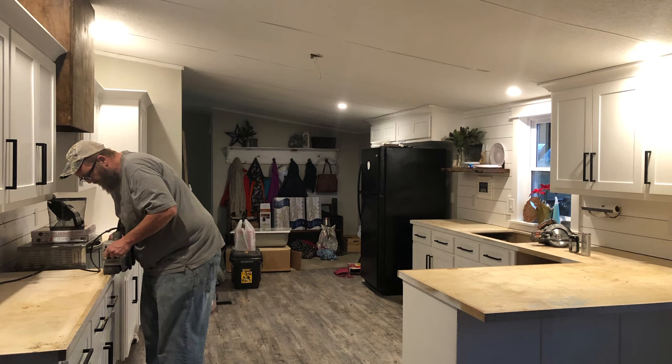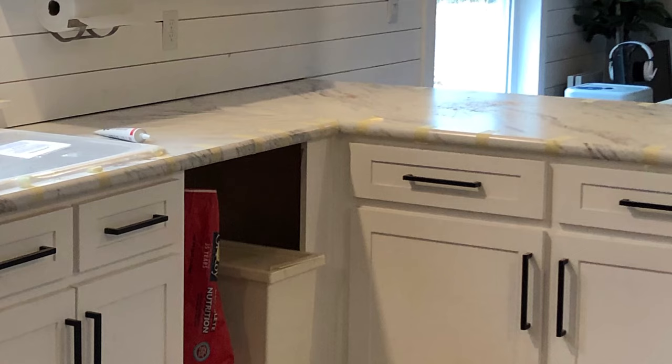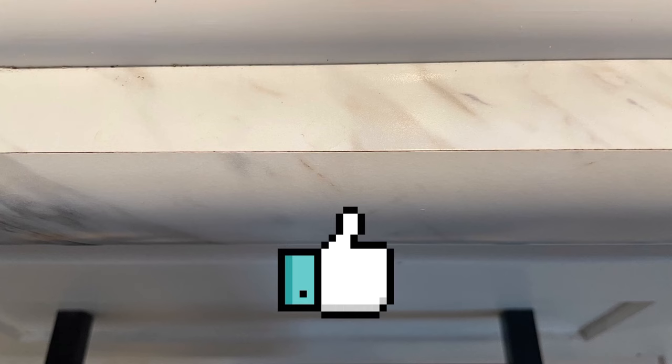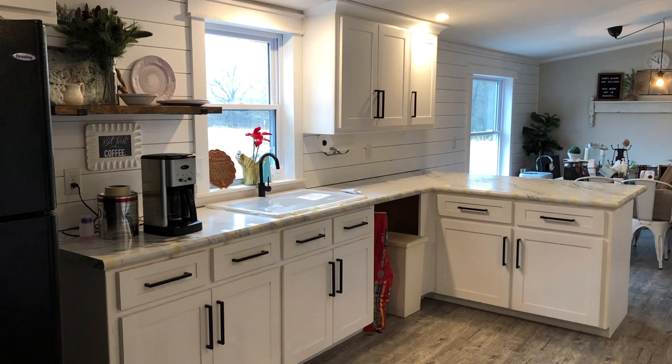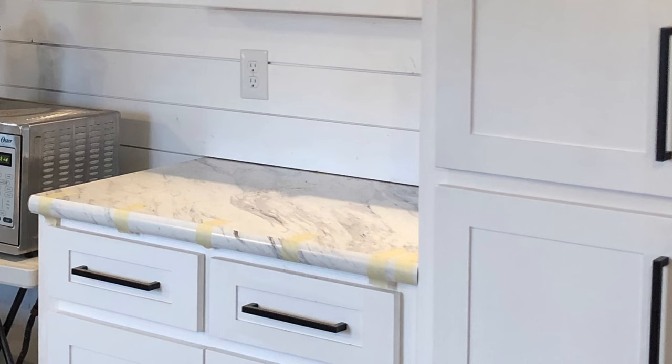Months later, it's laminate day — we could finally afford it! We laid it out to get it to lay flat and the cabinet maker let us use his tools to get the job done. We sanded down the wood counters, applied adhesive, and installed the laminate. The edges aren't quite perfect, but our counters cost us not even four hundred dollars. I ordered brackets on Amazon and used a two-by-twelve for the shelf above the coffee area. The sink is cut in and cabinet hardware is installed — I love the boldness the hardware adds. We have faux marble counters with a rounded front which elevates that basic laminate look.